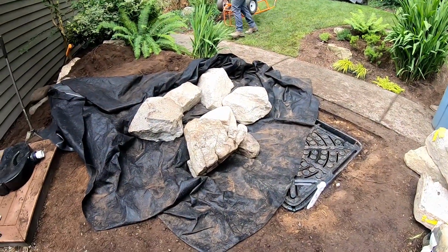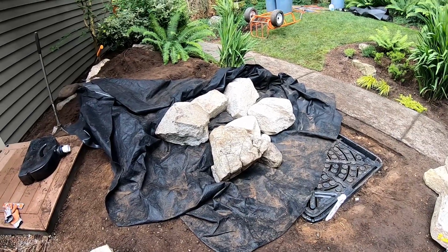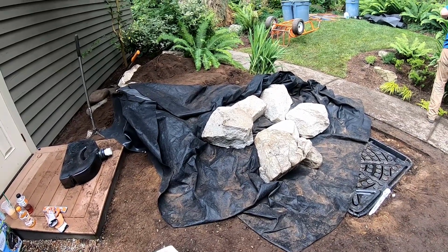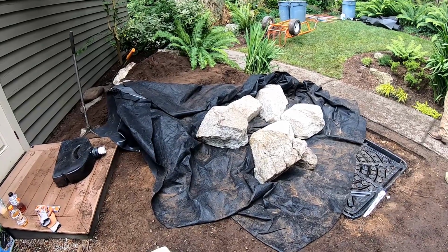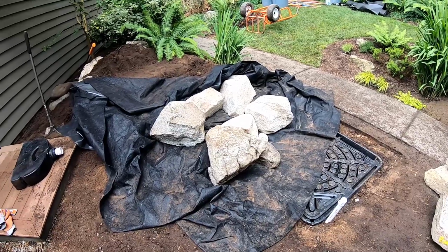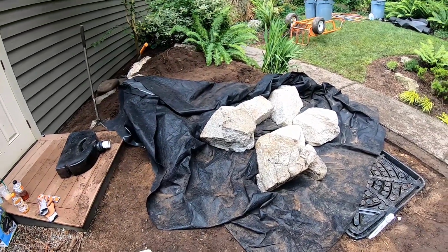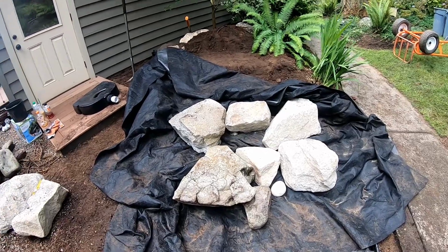So with the Babbling Brook package, we build this on an Aqua Basin, because what we're talking about doing here is building a short stream. So this is something that's gonna be 3 to 5 feet in length, probably no more than a 2 to 3 foot elevation change. Anything bigger than that, and we're not going to have enough water capacity to keep this thing running, because we typically want 2 to 2.5 times water storage in our basin to what is in motion while we're building the waterfall. So what I wanted to show you here is how we're starting to construct this waterfall.